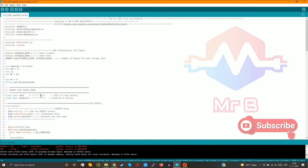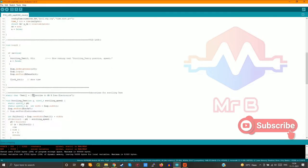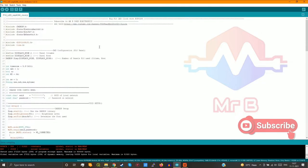Lastly, if you want to show any particular message — just like the scrolling 'Subscribe to Mr. Beeders Electronics' — you can change line number 78, and that message will be displayed scrolling just like what you saw. That's it for the programming you need to know; don't change anything else. If you're getting an error in timing, you can change the timezone offset — we are five and a half hours ahead of Greenwich Mean Time so I set 5.5. You can change this and play with it; everything else is self-explanatory.